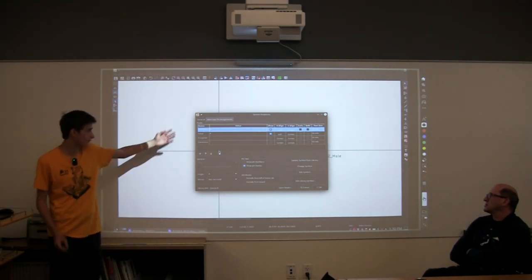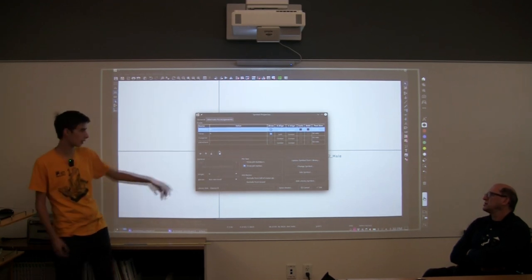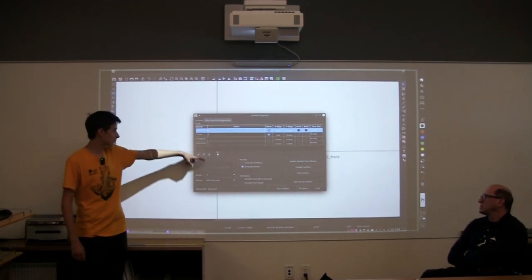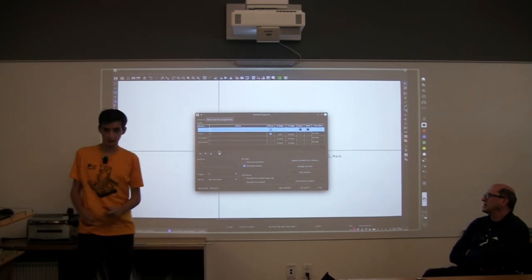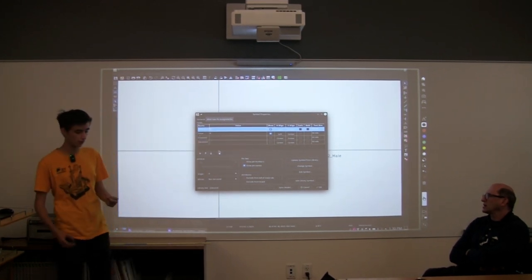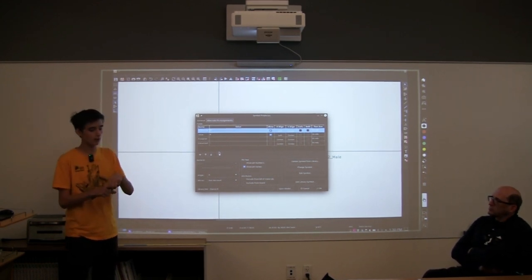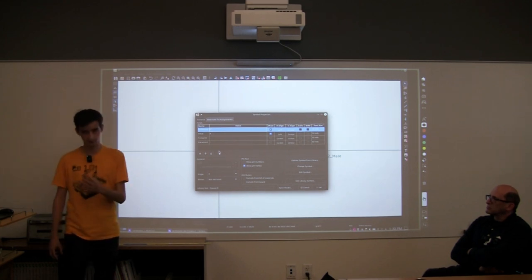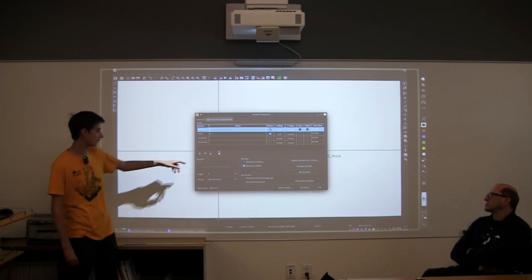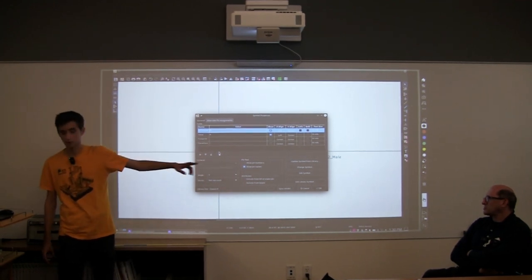So if you double click on a part, you get to see the symbol properties, the symbol being each of those little parts. You get to see these properties. There's values, there's reference numbers. The reference really helps you when you're actually assembling the board, with seeing what part goes where, so you don't mix it up during assembly. And then the value is like the unit, like we were talking about, 120 ohms for our resistor.